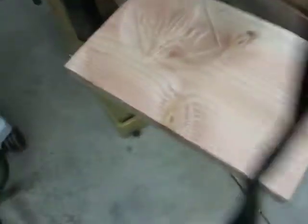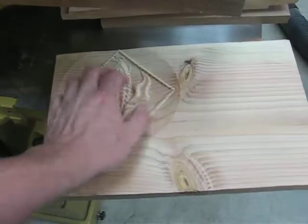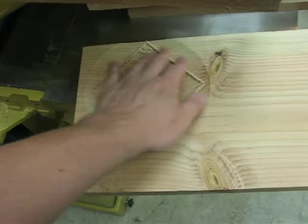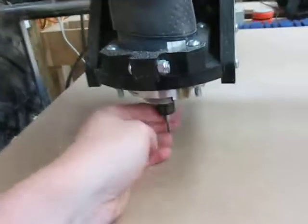Here's one of the things I was messing around with on the Shark. There's a corn design — I was gonna make some produce boxes with a piece of corn on it and paint it, along with a chili pepper, tomato, and things like that for farmers market. I kind of got that figured out. The origin offset is one of the settings in the Shark — if you don't know what it is, it changes how far away the carving is from zero on all the axes. The default was off by about four or five inches and I couldn't figure it out, but I started changing settings and figured it out. So yeah, the origin offset is something you need to monkey with.